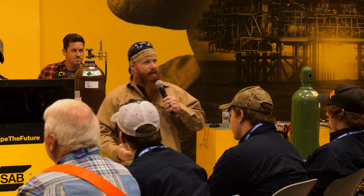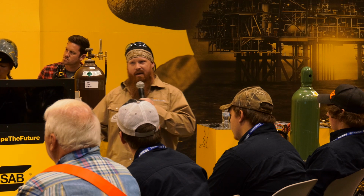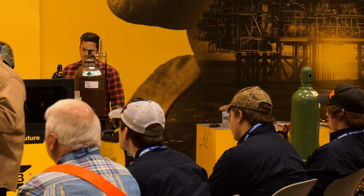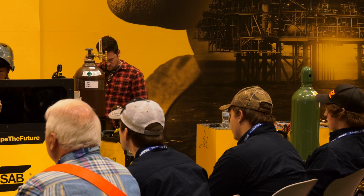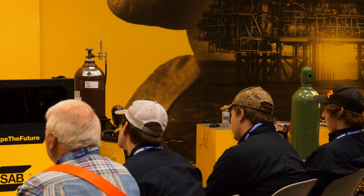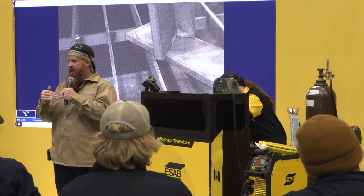And everybody says, well, what happens when I'm running half-inch plate? Is that same rule going to apply? Yeah, I've ran 1-inch plate certified through the Ironworkers Union using this same method. Ran 118 amps overhead, 1-inch plate. It's beveled, so you have to think about it as when that material is beveled, it's actually thinner at the root. It's no longer 1 inch.